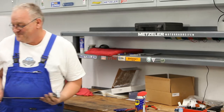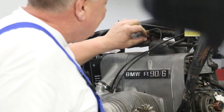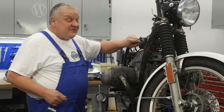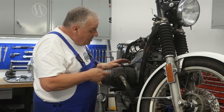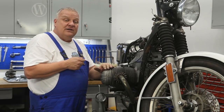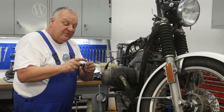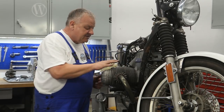Here we go — two of them, here they are. You always want to look inside the coil and make sure there's no corrosion in there. If you see any kind of green goop or anything, you need to scrape or sand it out. These look pretty good — you can totally see the copper and it should be fine, but it's very common to get corrosion in there. We're going to start the motor with the plugs out and spin it until we get oil pressure, then put the spark plugs in. For right now, I'm just going to plug these in and sort of ground them on the cylinder head. These plugs have to remove the little fitting on the end of the plug — just setting on there will be sufficient ground.